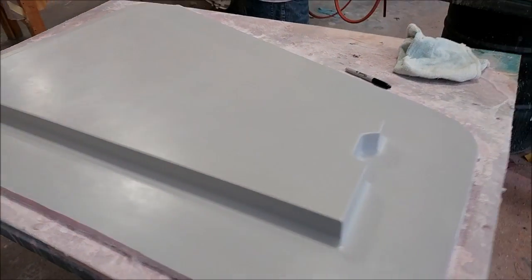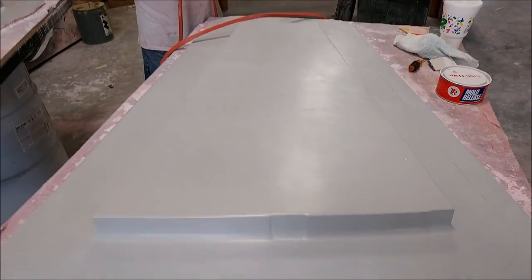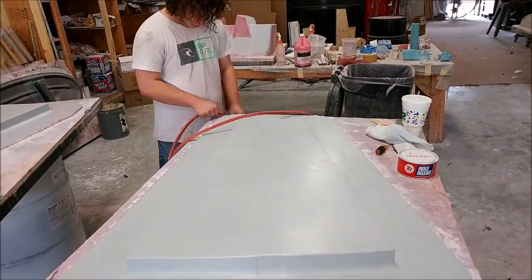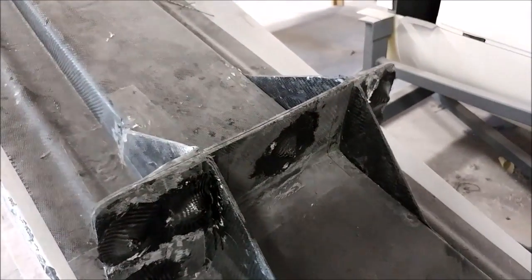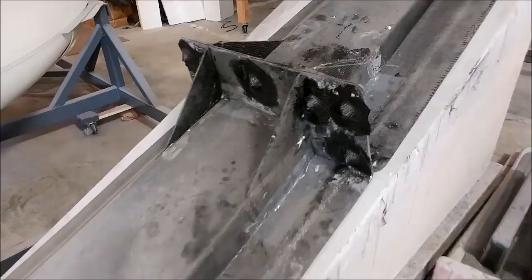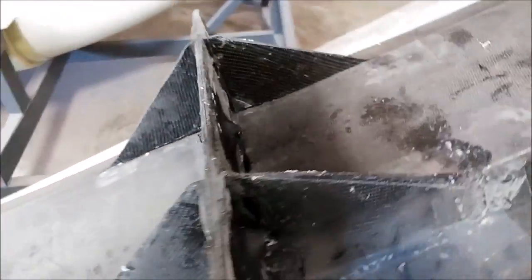Here are the A-frames that support the firewall - those are all waxed now and ready to have the rubber profile put on. You can see there's been marked out where the profile needs to sit, and Devon's getting sorted out there ready to put that on. And from last time you saw the bushings potted into place for the main spar mold - now they've had some carbon fiber put on there to keep those strongly in place, so that's all done.